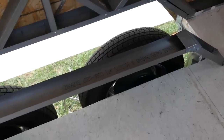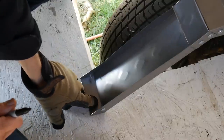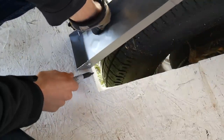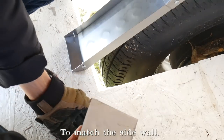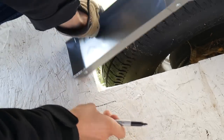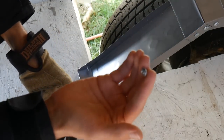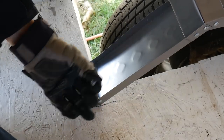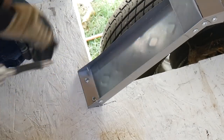Now we have that main bridge piece freestanding - the hardest part is officially done. Now you can really get an idea of why we needed to chop off those little corners. The next step is to anchor our main piece here. You can line this edge up with this edge, and to find the thickness you can either measure to one and a quarter inches - which is the thickness of these - or you can simply mark it out. Then I'm just going to pop down two screws. This isn't super structural, otherwise I'd probably go deeper with longer screws, but this will do for me.